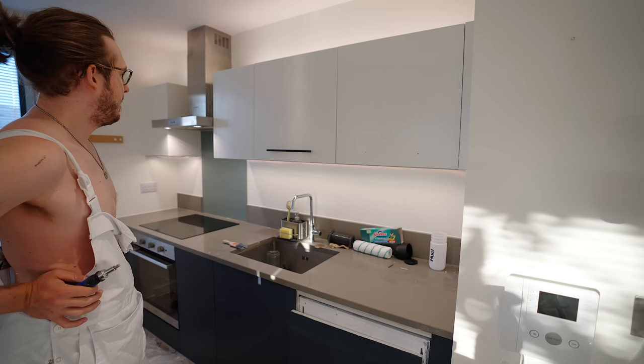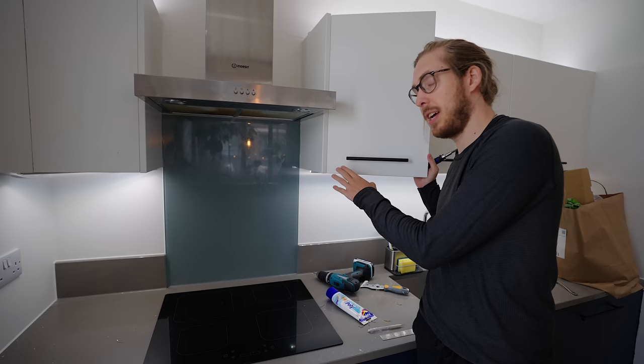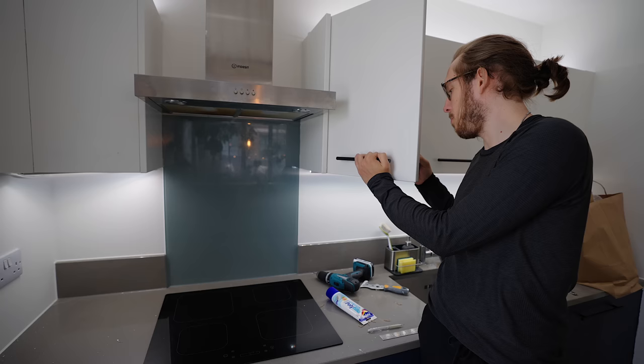Four of my cabinet cupboards have really weird sizes — I could tell they used imperial measurements, supposed to be seven and a half inch. So to make this work I used poly filler to fill in the holes and then put in new holes using a 3.5mm drill bit. Now I have the same matte black hardware as the rest of the house. Hell yeah!